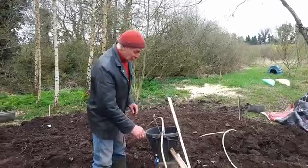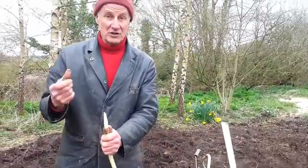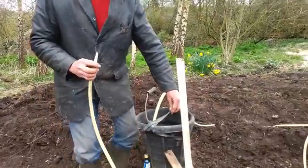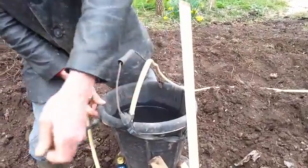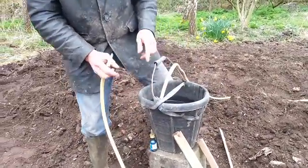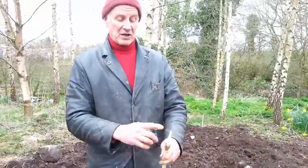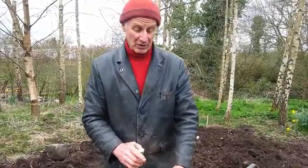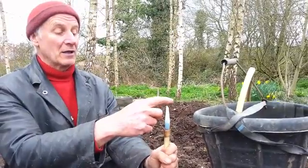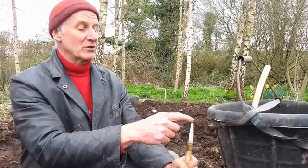So what the water level consists of is just a piece of garden hose — this was a piece of old plastic tube I found off the end of a gun. And some water in the bucket here, and a piece of rubber tube which wraps around and locks the actual pipe in place. Here I've got a bit of blue dye — we had to get the blue dye in so that we could see the water. I'll put it down here like this, the water level comes up. I just do that to keep it steady, to stabilize it, stop it from oscillating.